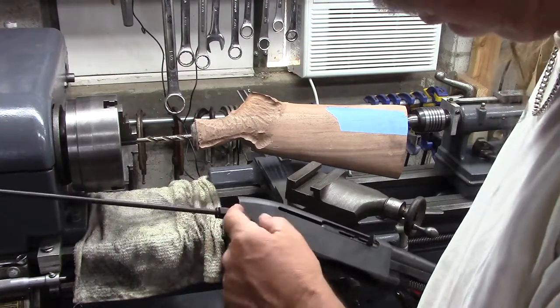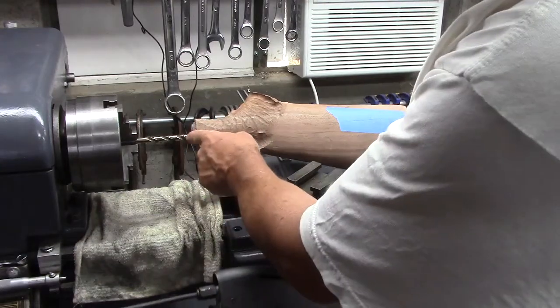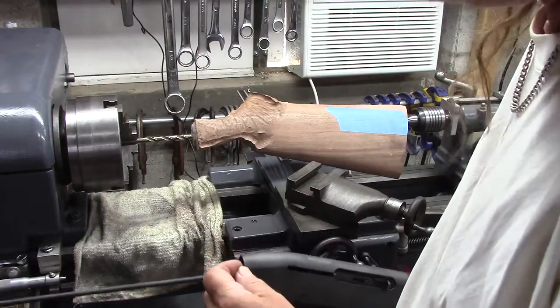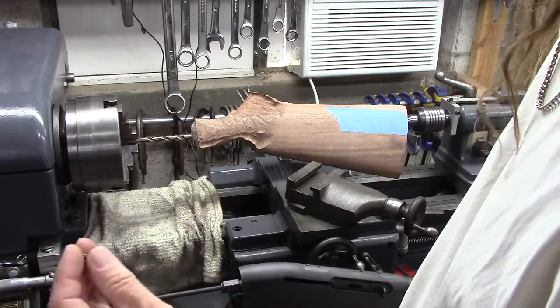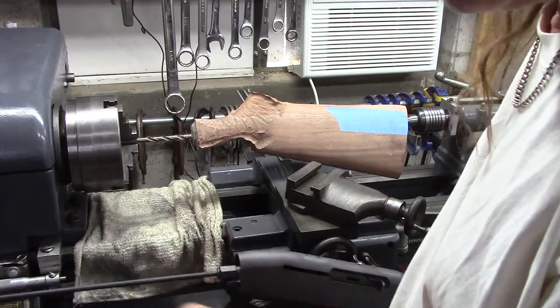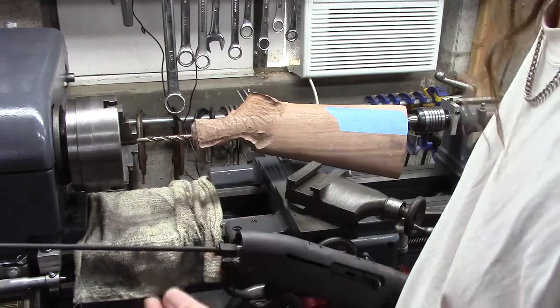In order to locate the center of that hole in the end of the stock, I found this is an unusual thread, but I found that 7/16-20, I think, the fine thread version of a 7/16 bolt, was able to engage about half a turn into the threads and therefore would hold itself there.